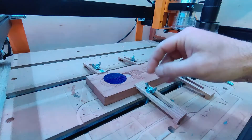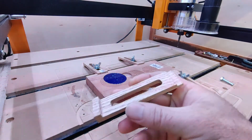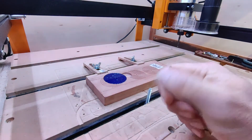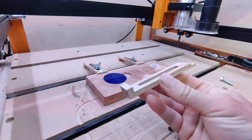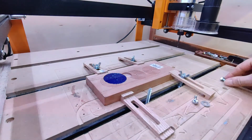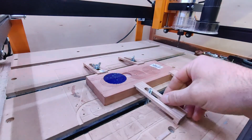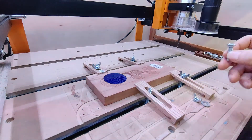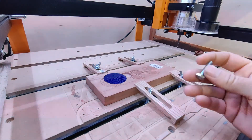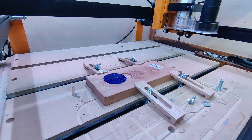The clamps I wanted to go a little longer, so I went ahead and used some scrap oak and modified a previous design I had used on another machine. It's pretty simple — it's got a step down here and a step in the back, so you can use it as a lateral hold with smaller one-inch bolts, or with the step down you can use longer inch-and-a-half bolts. This is standard quarter-20 hardware from a big box store — Home Depot, Lowe's — with wing nuts and washers. Modeling everything quarter-20 makes getting replacement hardware really easy.